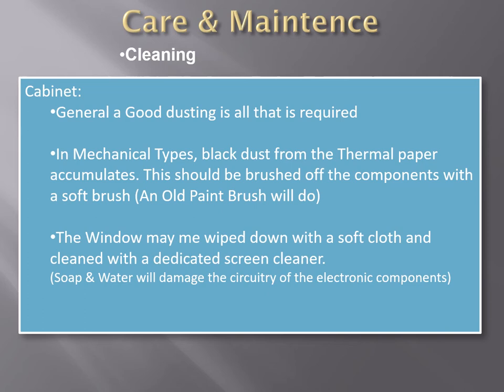In terms of transducer maintenance and dry dock, I have mentioned some of it before. I'll repeat myself. The transducer normally needs little attention. However, the radiating face should be cleaned when dry docking. Use synthetic soap. Marine growth may be removed with a piece of wood, whereupon the radiating face of the transducer is carefully cleaned with fine grade sandpaper or emery paper. The radiating face of the transducer should never be painted. The recorder should be cleaned at regular intervals. A brush is fine for this purpose.